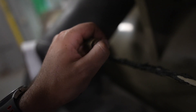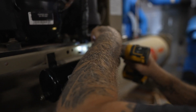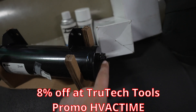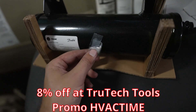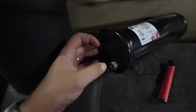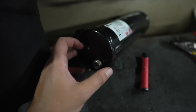Make sure in this process that this little flange here is clean. This should have pressure on it from the factory, so be careful whenever you go to open it — you want to hear a little bit of a spurt. Also when you pick these up, make sure they've got the O-rings and they're in good condition. We're going to put some nylog on these — they will fit inside of there just like you see on this side. Those do compress down and I do not recommend reusing those.